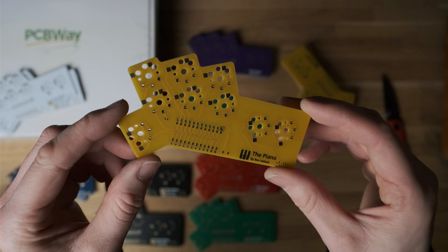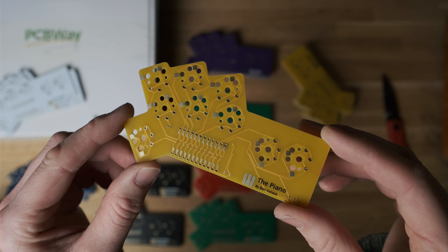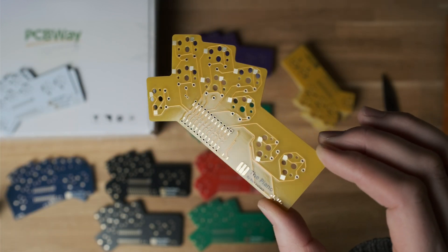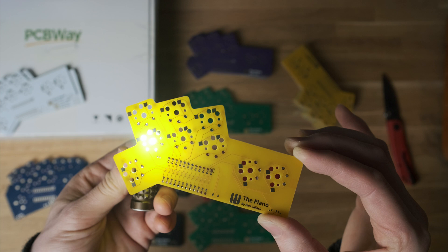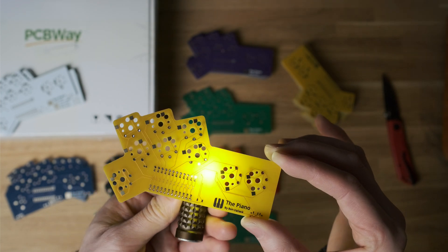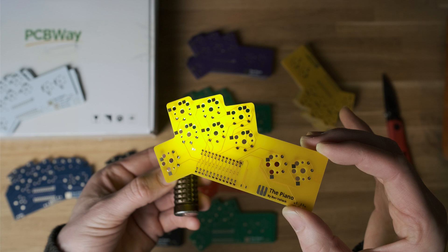This is the yellow — a very vibrant primary color. In particular, this is extremely see-through; you almost can't look at the torch through the board it's so bright. This is probably the best option if you want to reveal the copper layer through the solder mask, either for the trace routes themselves or for artwork. You can see the translucency catching on the edge, with light bleeding in — you're definitely aware of it being more translucent when you hold it.